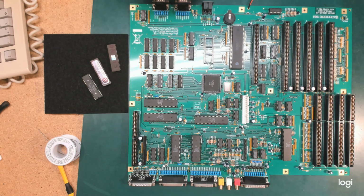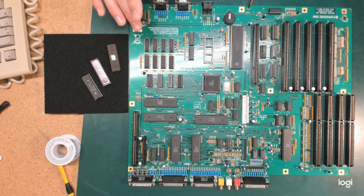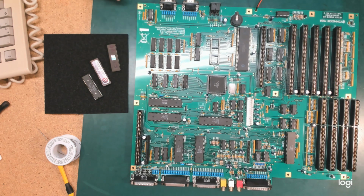The fault was slightly intermittent. Very occasionally the problem would shift around a little bit in terms of its location on the bus. Well, in terms of the region in which the errors occurred. And that was probably because occasionally the pin would be touching on the side of the hole. But having used turned pin sockets for the RAM, they had a beautiful clearance all the way around, or it had a beautiful clearance all the way around.